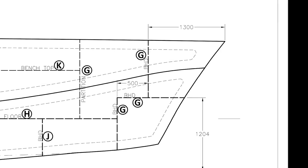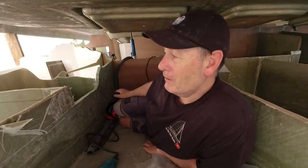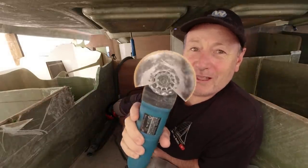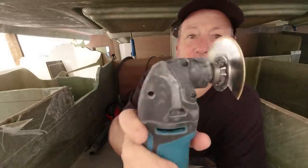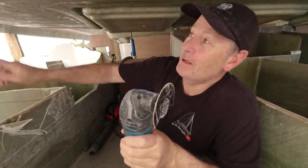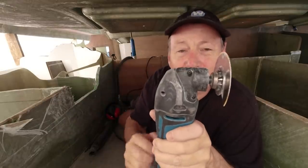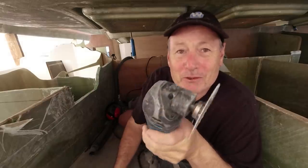The problem is I could get a small 100mm grinder in here and have this job done in about two hours. The other option is the oscillating tool — incredible, sensational — but the issue is the face is only 2cm. What's holding me back from cutting through on the other side is that the space is only about 25cm high because I'm cutting 15cm off. It's not so much the blade — it's the butt of the tool that's the problem. If I could cut 2mm off that or sand it flat, I reckon I'd be breaking through and doing half the job.